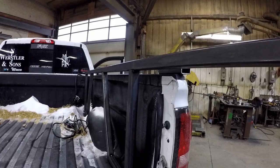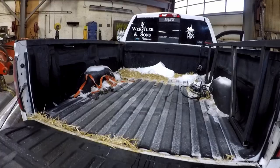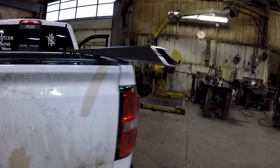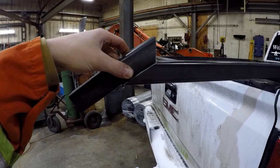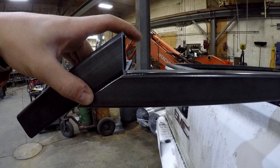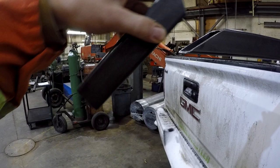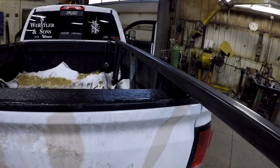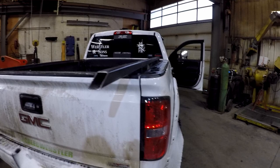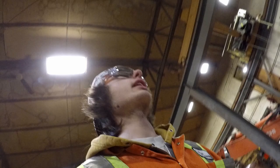I gave myself a little over a quarter inch clearance to clear the ramp over the tailgate and make sure the tailgate doesn't run into anything. We also got the step figured out for the little drop-down bit — the deck will come to here, then this will be a drop-down, and then we got another bar going across. We're going to weld the legs first because they'll be a pain to weld after everything's tacked together.